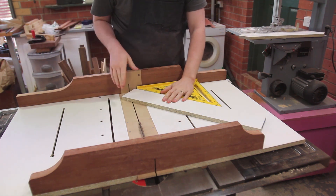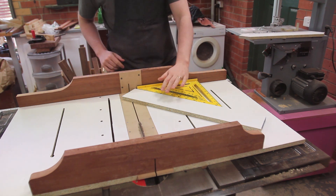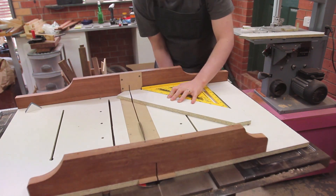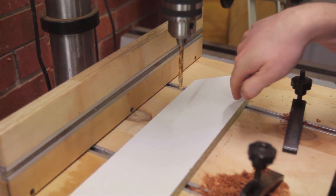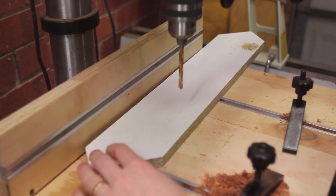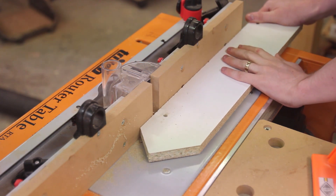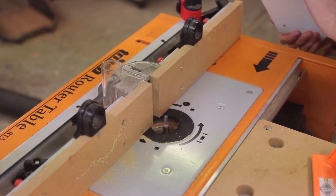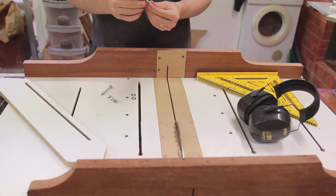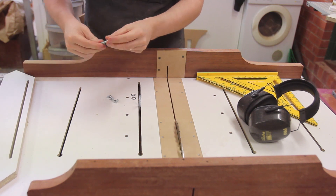This point doesn't have to be a perfect diamond point, but it is there so we can get closer into the back fence. We then need to drill quarter inch or 6mm pilot holes for the router, for the slot where the screws will go. I realized my router was set just below the surface of the fence — I thought I hit stop on the camera but I didn't, so you'll have to use your imagination for that part. I've got a quarter inch bolt with the sides ground flat — you can just use a T-bolt specifically meant for T-tracks, it'll do the same job.